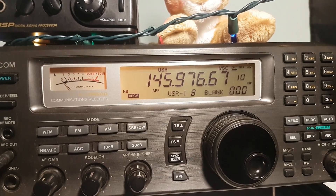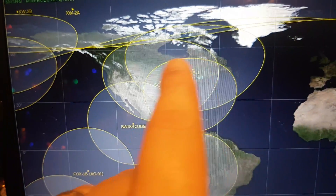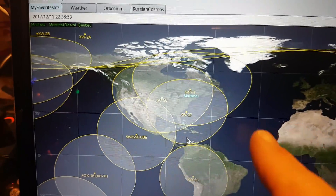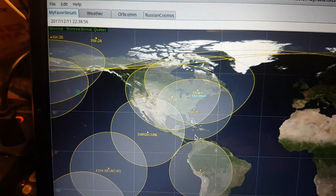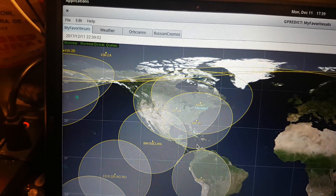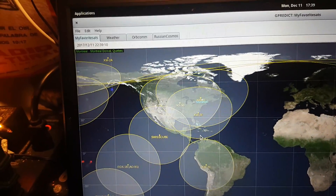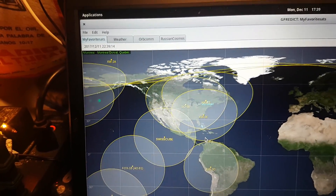As it's moving in, one little trick: the satellite often has one side that you hear better than others. There's kind of a directivity on the antenna, so sometimes you hear the satellite better when it's coming towards you, sometimes when it's moving away. It all depends on the positioning of your antenna and the satellite's antenna. A lot of the signals will go up and down in strength because sometimes the satellite is spinning on itself, bringing the signal up and down at a regular interval.